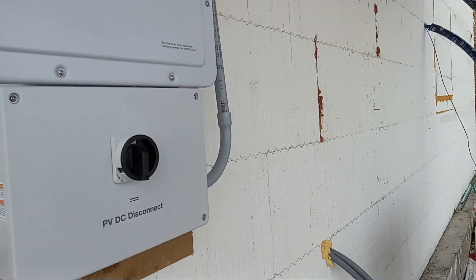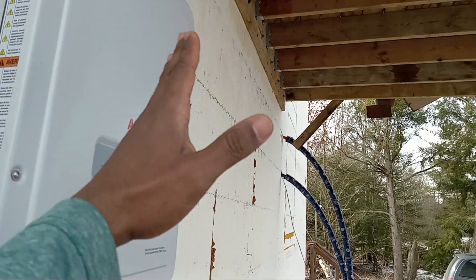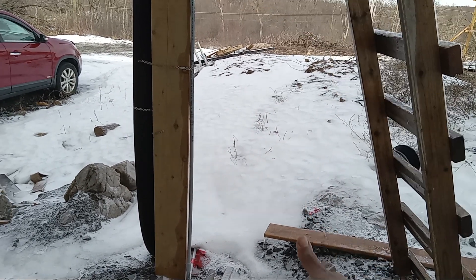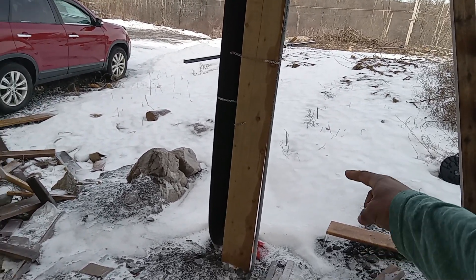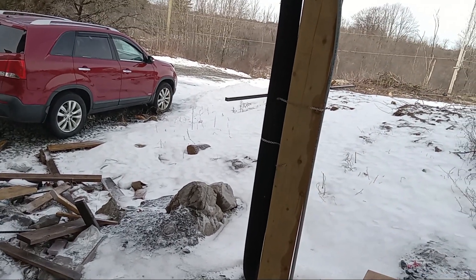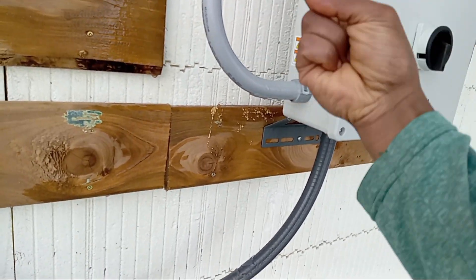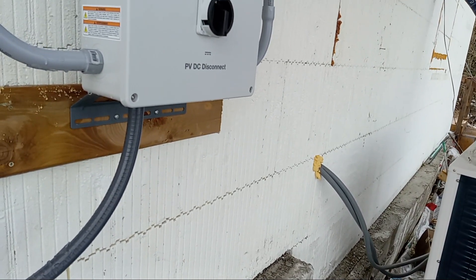What they frowned upon: I have a grounding cable — number 12 — that runs into the three-quarter inch conduit and grounds the system, but there's no grounding cable in the half-inch conduit. Those two conduits do come together under the trench, so there's some protection if someone digs in. They were not fully okay with it but let me pass because the run is short and it was too much rework — though technically, every conduit with live conductors positive and negative should also have a grounding conductor.